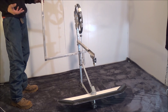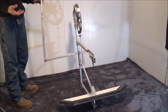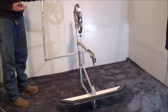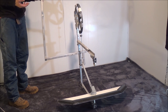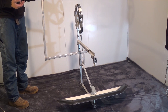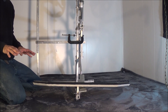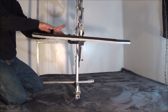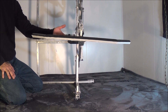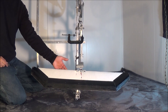Throughout a series of videos, I've showed you the progression of an idea. Today I want to show you a fully working model that we're going to go out and test here in just a couple weeks. This was the simplest design I could come up with that would function pretty well and generate power from something as simple as a moving water flow. I'm going to go ahead and just oscillate through this cycle and show you how this works. That's the top end of our cycle and you'll notice there's about a five degree down angle to our hydrofoil, which means the water flow hitting our hydrofoil at five degrees is going to bring it back down.